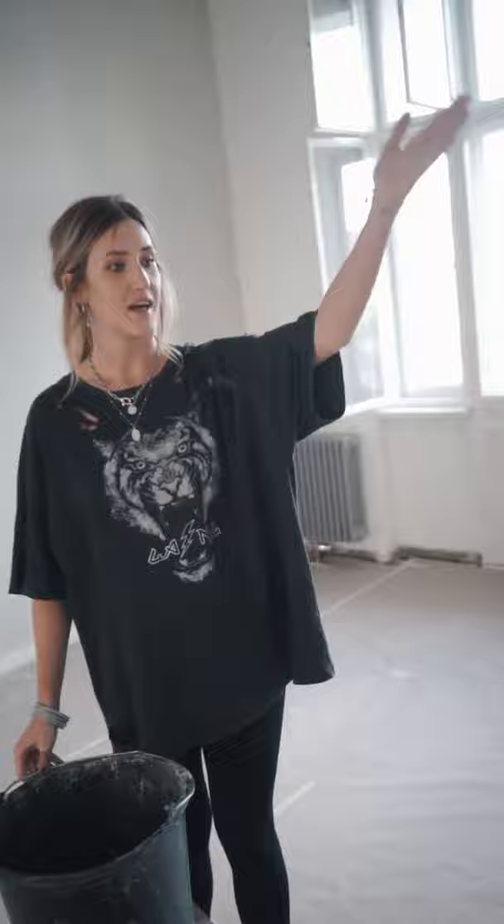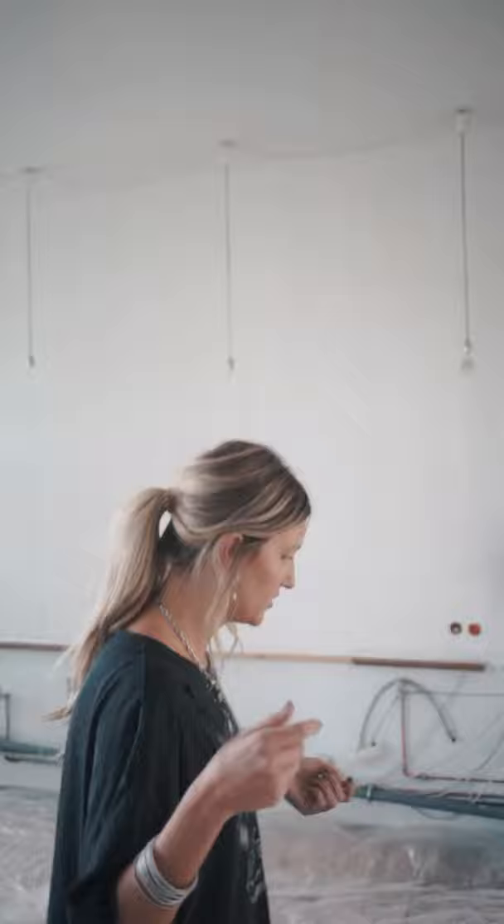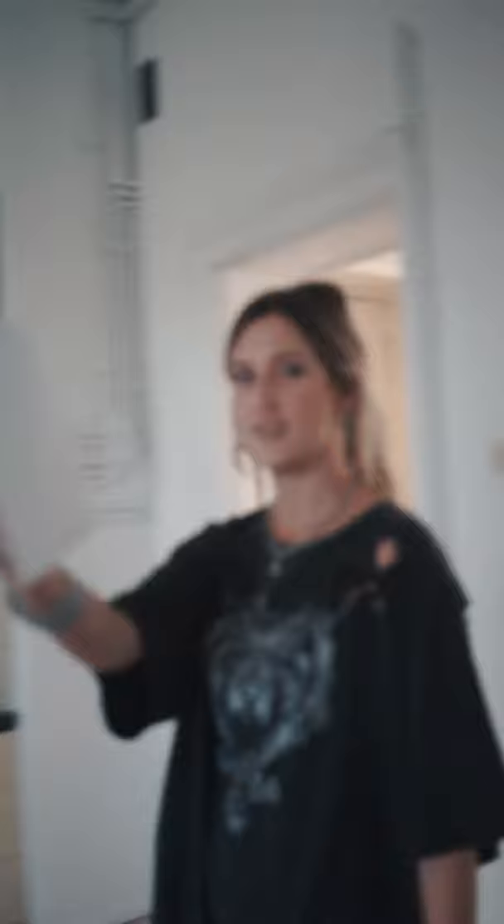What we're going to do now is paint the kitchen wall. We are going to paint the same Palladio color, but we're going to do it in a different way. It's stucco, which means you have much less water, so it's a thicker paste. And you put it up with a little spatula — with this guy! Different than a brush.